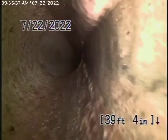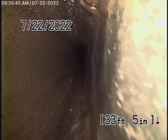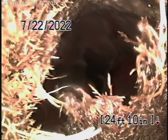This looks like it's in pretty fair condition. It's difficult to say whether this pipe is an asbestos pipe or a clay pipe — it's very predominant in this area. It appears to be still in fair condition and looks pretty good. Then it comes onto the property and changes to a clay pipe, about seven feet deep at the sidewalk.